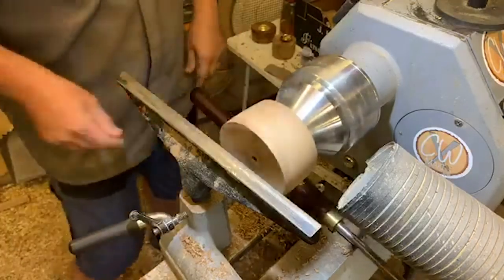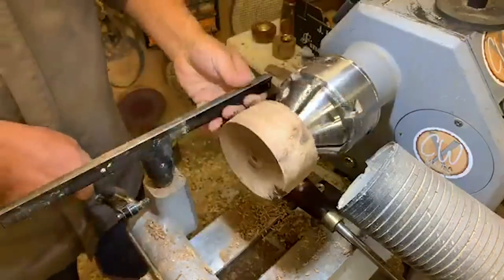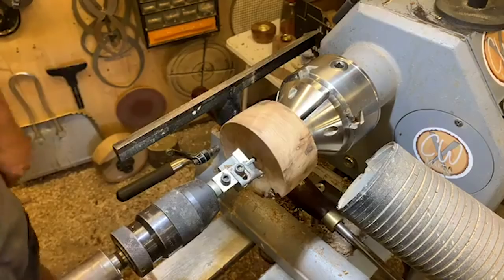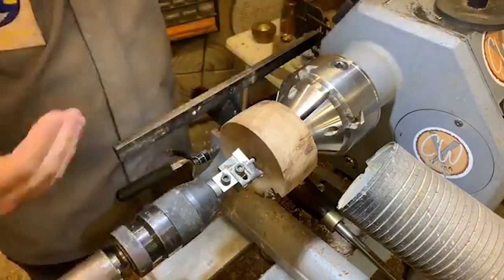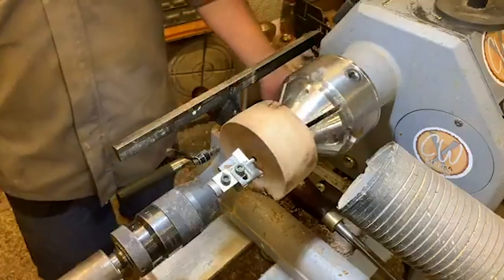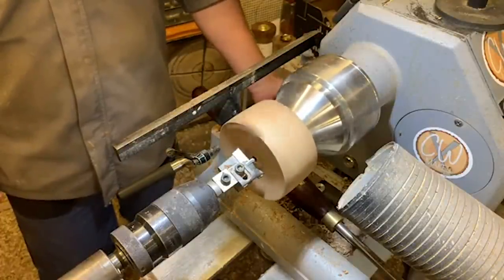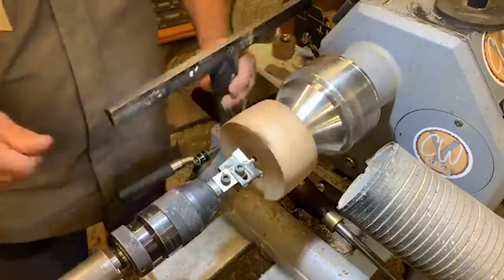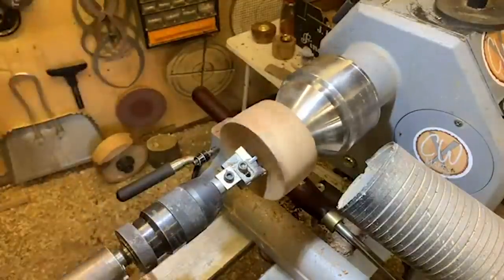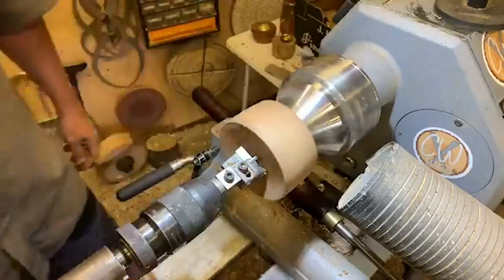What I was doing there is just making that dish. Now I can start drilling out — I've left that little bit there which is going to be my feature. The drill bit is ready. I've already checked the lathe is running accurately using the kiss test — brought the two centers up together to make sure they met. Lathe speed to zero, start at 900 RPM for this particular drill bit. Let's get the tool rest out of the way. I need to go just to the depth I've already marked.